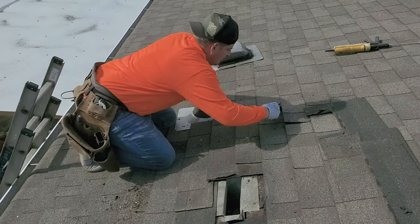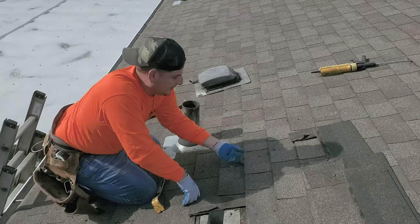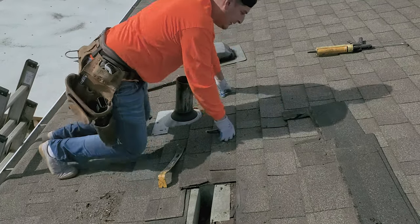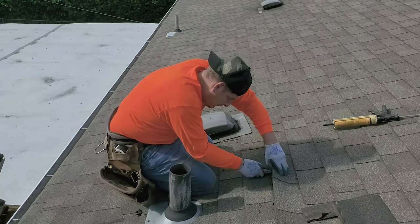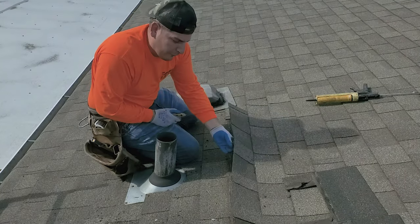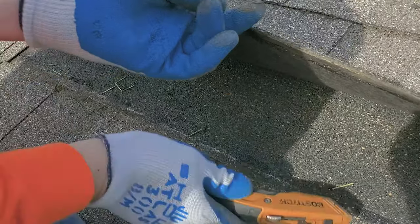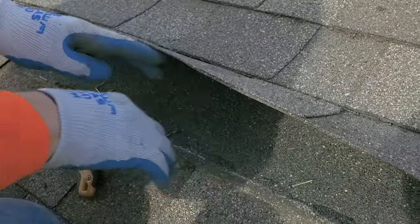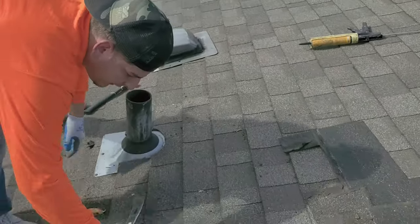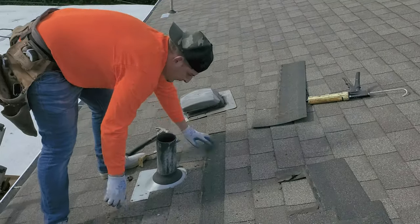Break the seal. Whatever shingles you want to take off — that means I need to take off the staples up here. Let's go ahead and take that staple out. Look how easy that is. My wife can do this stuff. That's come off, and you can see the rainbow effect on this guy's staples. What happened is after a few years, this rainbow effect — see how it's nice and straight over there — this rainbow effect will come off and pull off. The strength lies when it's straight. If you do use staples, which I don't even think is code here.